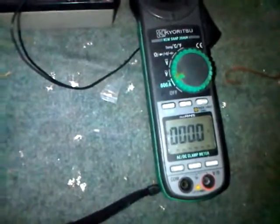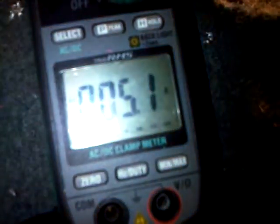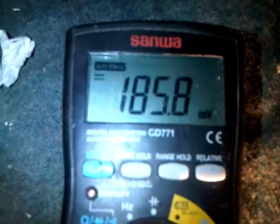It's weird why the low beam doesn't work, but it doesn't matter anyway. Let's measure the power it produces. I'm triggering the MOSFET right now — the light bulb lights up. Currently dropping at about 5 amps, and the voltage drop across the MOSFET is about 200mV.